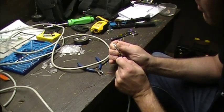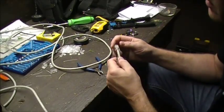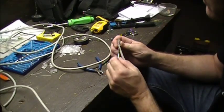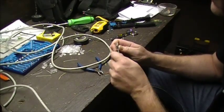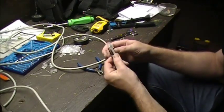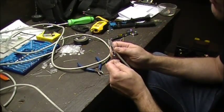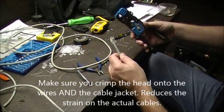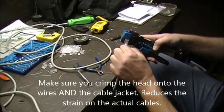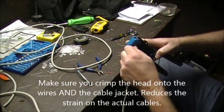You take the screwdriver, you want to push it all the way in, and you're going to feel a little chunk. Just like working with cables and pulling cables, you're going to get used to feeling things. You want to get it all the way up there flush. As you can see, the jacket — that's no good. You can see that we have this much space. But I know already, because I'm the king of network cabling, when I put this in, I can maneuver this jacket in a little bit better.